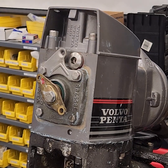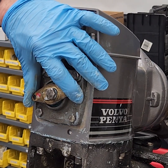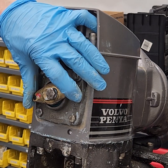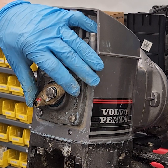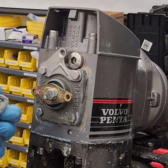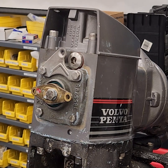There we go — the prop shaft spins free. Let's check it one more time: as I come up on that cam right there, it locks up as I'm coming off the cam — that's right where it starts to drop into gear, and you still have travel left to drive it further into gear. After a pressure test, I think we're done — finally, a long winding road on this one.